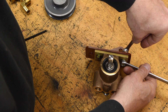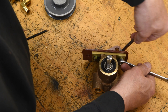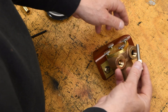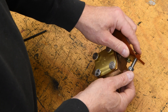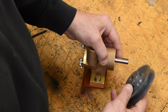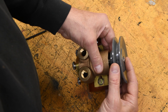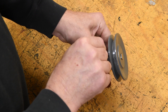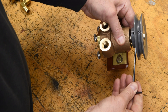You can go ahead and fully tighten the nuts at this point — I'm using two half-inch wrenches. Now we're going to turn in our stainless steel tensioning bolt, just so it's flush with the nut. Next, we're going to put on our half-inch pulley. Make sure one of the set screws lines up with the flat on the pump shaft. I like to leave about an eighth of an inch of shaft protruding from the front of the pulley. We'll go ahead and tighten down our set screws good and tight. You can use a 5/32nd Allen wrench or a 4-millimeter — both will work.